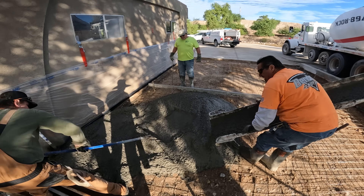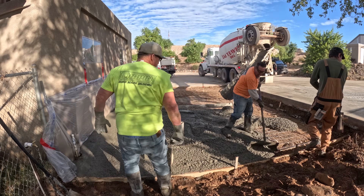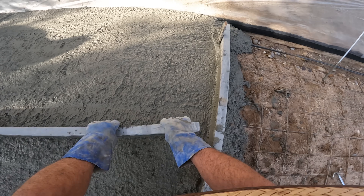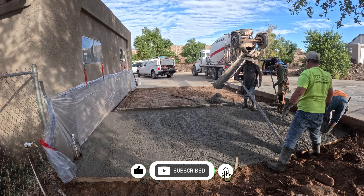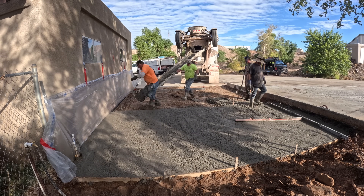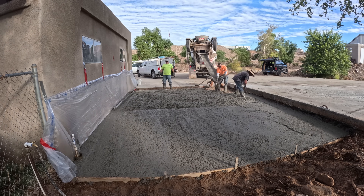We've got Kenny out here today. He's not pumping the concrete but he is going to help finish this. He came up with a great idea — I was initially planning to just go ahead and dry pack this after the fact once the structure went up. But he decided he could fill it in and dry pack it under this curb. We're about six inches below the back of the curb at the bottom. So we've got a big dirt exposure, possible erosion, a lot of issues there. What he came up with is to throw a few buckets of concrete on the side, let it harden in the bucket, and when it gets about right, pack it in to that curb face. That's what he did — we're going to show that process. It worked out real nice.